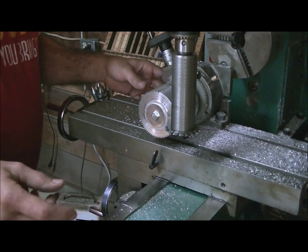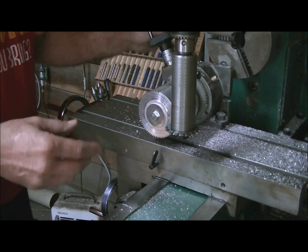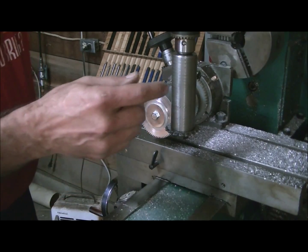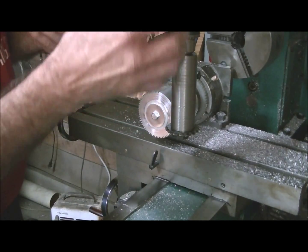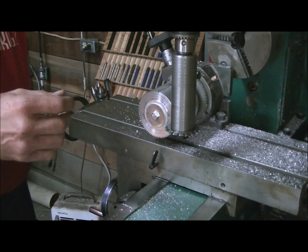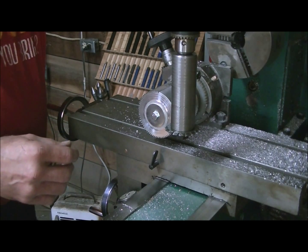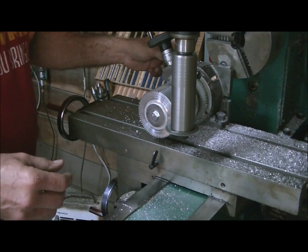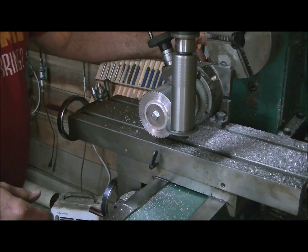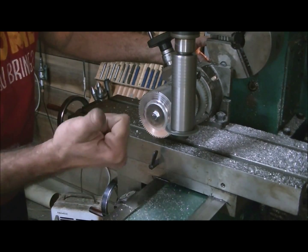What I'm also doing is having the lathe move the table through. I've got the lathe part running in reverse. I took the jaws out of the lathe so they wouldn't be in the way. And I have the mill — it's just a glorified drill press really — turning forwards. Let me get her all set up here. We'll turn the mill on — it's spinning up pretty fast. I'm going to quit talking and just do the operation. I'm going to turn the lathe on in reverse so that it'll feed the carriage this direction.